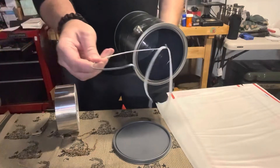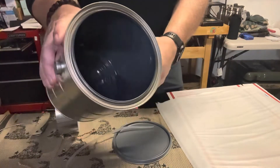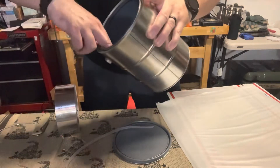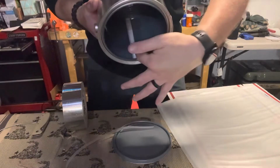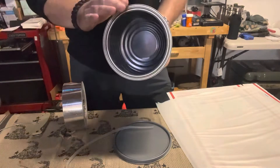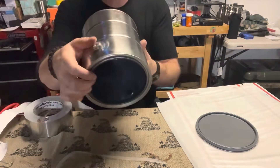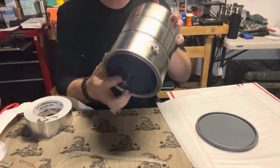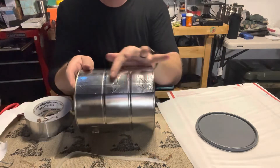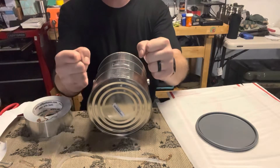The first thing we're going to do is pop this off because we don't need it. Now there are holes here, and you can see inside there's a little dimple. So we're going to cover the inside with the tin tape, cover the seam, and run a bit around the bottom. So we taped the inside, got tape there and there, and the seam is taped inside and outside. These seams are pretty good, especially here, because it's metal touching metal, so it should hold really well.